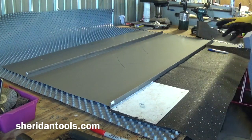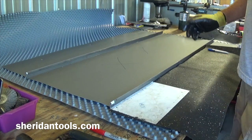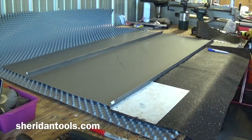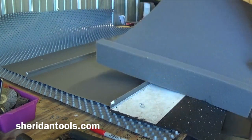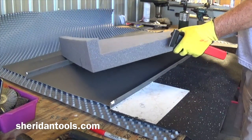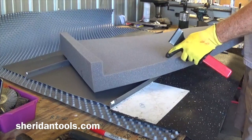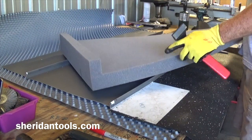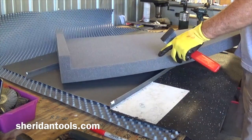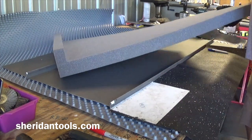You also want to try and watch your foot traffic. I always wear softer shoes, I always wear knee pads, and I always keep my body weight on a foam pad of some sort. Like I said, these shingle pads work really well for that. Good up to about 6/12 pitch. Once you get above that, then you got to take steps to set up safely.